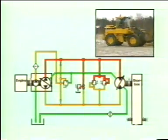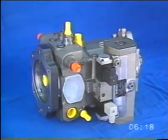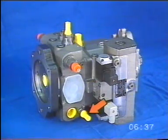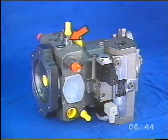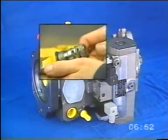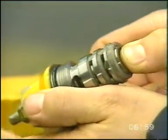To reach maximum speed, the hydrostatic pump must be at maximum displacement and the hydrostatic motor at minimum displacement. On the hydrostatic pump there are two solenoids, one for the forward and one for the reverse gears respectively. Checking points for high pressure forward and reverse. Checking point for charge pressure and charge pressure valve. Pressure cutoff valve for maximum working pressure in the system. The adjusting device is positioned under the security seal, control valve and two shock valves. The brain of the system, the regulator valve, determines the extent to which the hydrostatic pump is angled and thereby also the magnitude of its displacement.